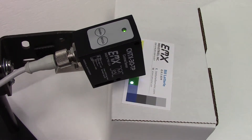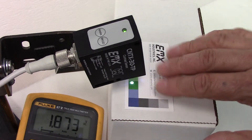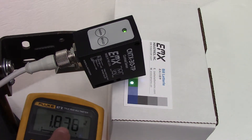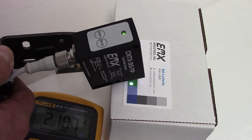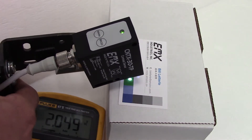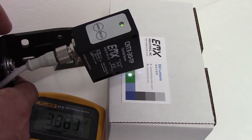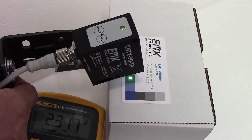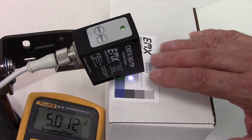That is the setup and programming of the sensor. Another option for applications where there is less of a difference, or a more precise measurement needs to be made, is that a voltmeter can be connected to the analog output and then the sensor distance can be adjusted for the maximum output. On the dark green target, as we slowly raise the sensor, the voltage level will go up, reaching about 2.3 volts at approximately 28 millimeters — consistent with the visual focus method.